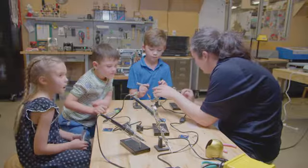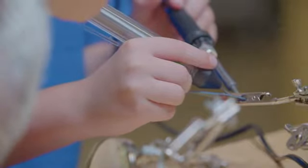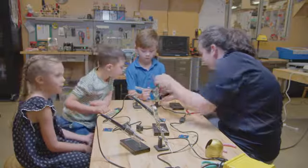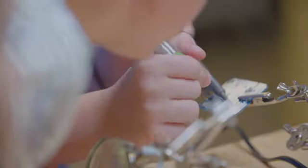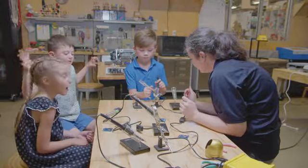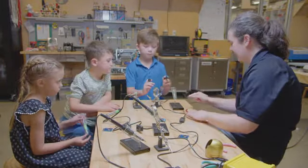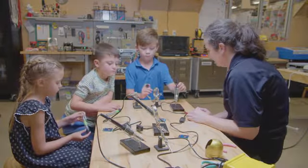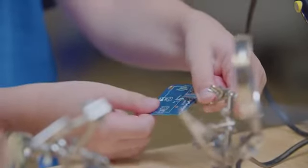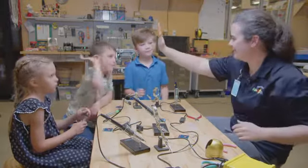If you put the tip there, get that hot and then touch it with your solder. There you go. Perfect. That's good. That's plenty. And then we'll go to the other side — I'll tilt it a little bit, it's easier to get in there. Then get our solder in there. The solder is really what makes a big, big thing. Okay, I think that's good. And we put it back in the holder. Then we'll unclip that. And a little tug test. Awesome, we all passed. Round one is done.